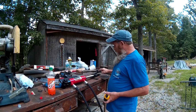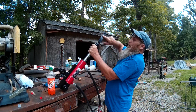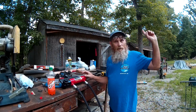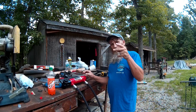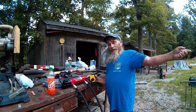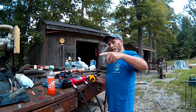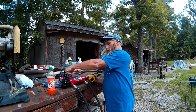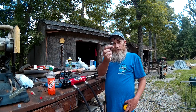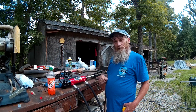and then using the lower hole, because I put 2 sets of holes in here. I put a set here and a set here. They're 1 inch apart, exactly like the one on the opposite side has 2 holes, and they're 1 inch apart. Then I measured, I've got that one set in the lower hole, and I measured from the center of the top link pin that goes into here down to the top of this that goes through this hole, and I saw what my measurement is.